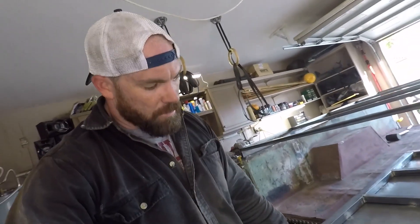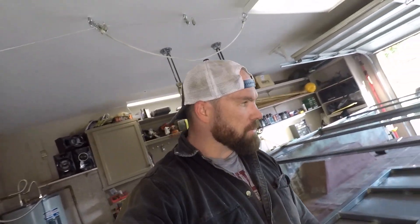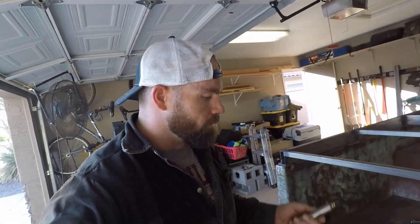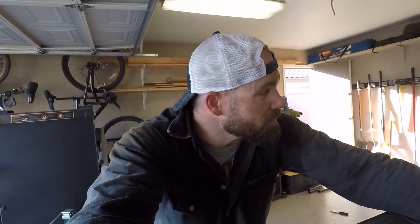All this sheet metal, if I haven't said it before, is 16 gauge — nothing crazy, but should be stout enough. I did 18 gauge on the sheet that's going to go up here, and I also have some additional square tubing over here, and those will go in between — the 18 gauge. I'd rather have a smaller gap between the supports there, as well as just general support on the top here when it's bouncing down the road. I'm still at the bullet hinge idea. The more I think about it, I don't like the idea that it's not removable, like the back slide there, but it is what it is. These things are supposed to be rated to like 500 pounds, so. Well, that's it — appreciate you guys watching. I don't know if I'll keep this episode going or switch over to a new one, but I'm done for the day. Adios.